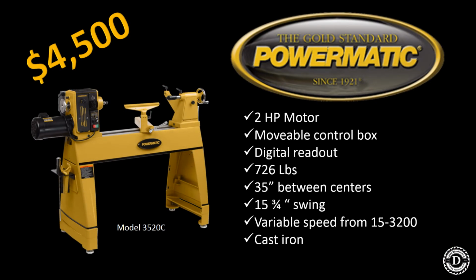Our last brand of the day is the Powermatic. They are a full-size lathe with a higher horsepowered motor, higher distance between centers and swing, usually are variable speed, are very heavy and pretty spendy. They do have additional features, however, such as a movable and tilting headstock that allows you to move the switch to either side that you want it on. They also run over $4,000.